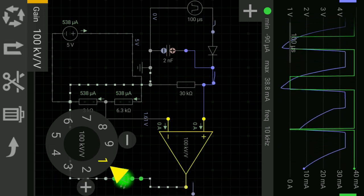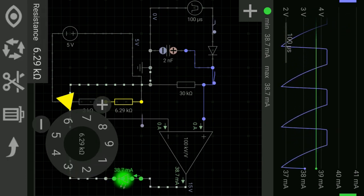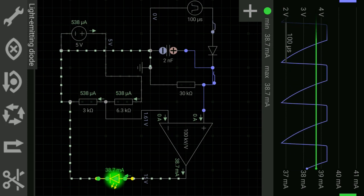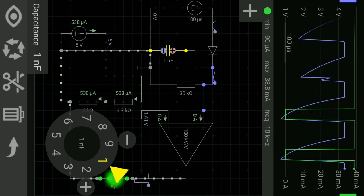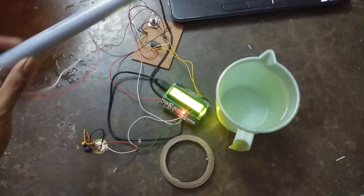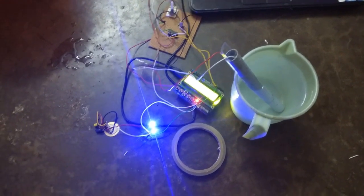You need to tune the potentiometer to adjust the op-amp output. The signal given by the Arduino in the simulation circuit is a 50% duty cycle — 100 microseconds high meaning 5 volts, and 100 microseconds low meaning 0 volts. The circuit diagram for the whole project is at the end of the demonstration. The Arduino program is at the end of the video — you can copy the program from the screenshot. The microcontroller, ATmega328P, generates a square wave of 100 microseconds high and 100 microseconds low.